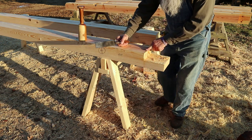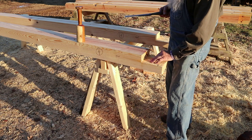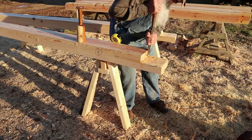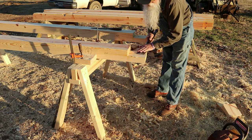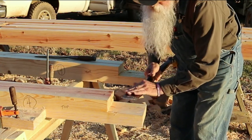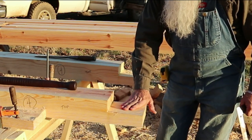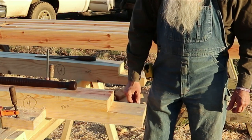So I'm going to do the undercut first. When I'm talking about the undercut across here, I'm going to leave this right on the line. And when I put the other half of the rafter together, I may want to make a silky saw pass between here and here to get a good fit. That's why I'm giving myself just a little bit of undercut. Then I'll come back and clean up to the line. You want your chisels to be really sharp when you're doing this. I'm just using my slick to clean this up, down through the score lines that I made on the top and the bottom. I'm giving this just about a thirty-second of an inch of undercut. So when this rafter mates up to it, it'll be touching here and here, and I'll clamp it when I put the peg in through there.